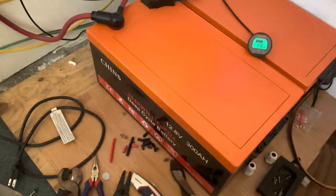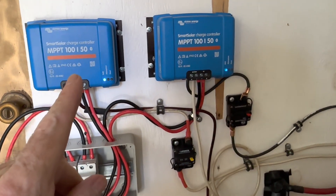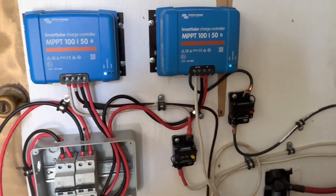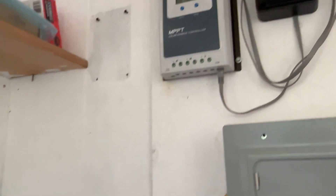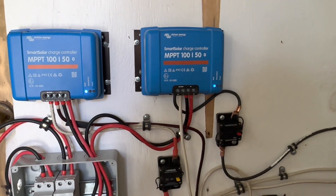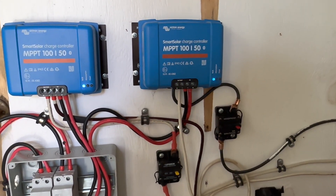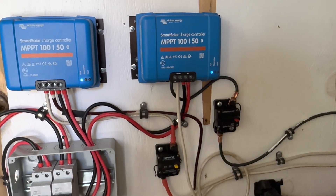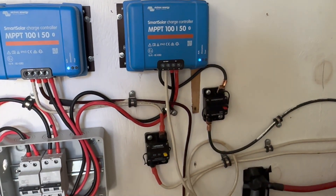That's what I was looking for. Now I'll be able to keep this battery bank up to full much faster. As a side note, yesterday I let both the EP Ever and the old Victron finish out the day of charging so I could give you a final comparison: the Victron put in 1.82 kilowatt hours into the system, while the disconnected EP Ever put in 1.1 kilowatt hours. The Victron outshined the EP Ever by 700 watt hours — which is too much of a difference, especially with the intermittent clouds we get here. I want something that moves fast and keeps it wide open until it's truly fully charged.